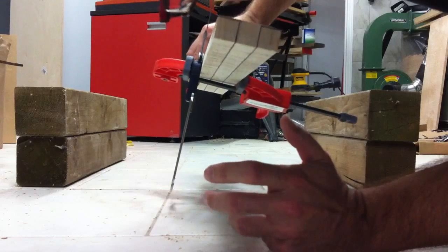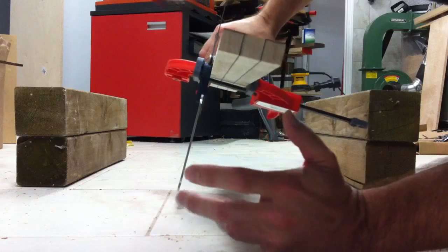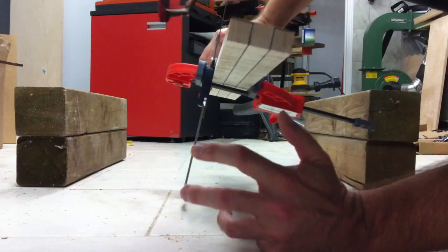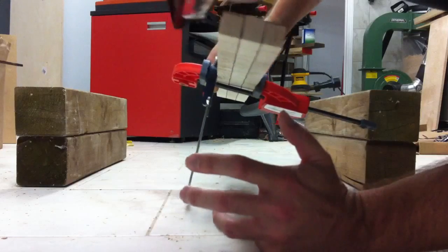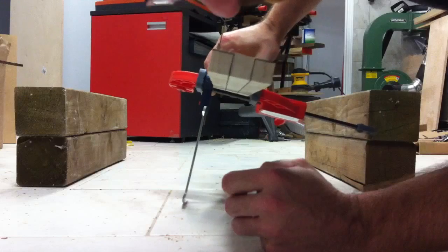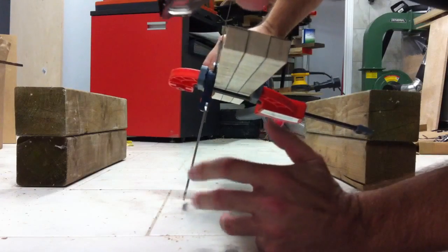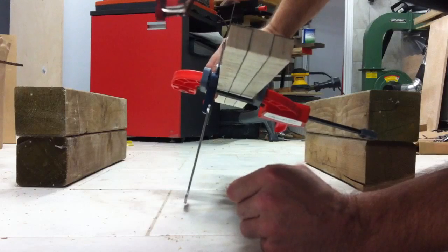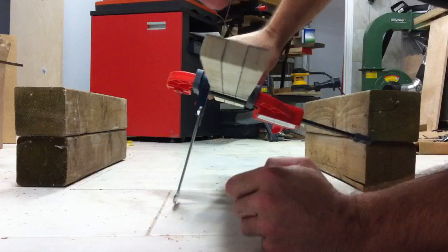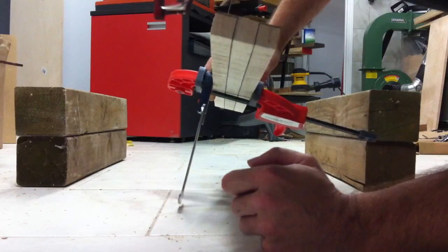With that in mind, I thought I've been thinking for years that I might want to try that with aluminum — with some aluminum L-sections. But combining aluminum with wood is sometimes troublesome because aluminum and wood expand and contract at very different rates, and that's been tried over the years with varying degrees of success. So I thought about carbon fiber. There are some pre-made carbon fiber angles out there, but I thought I would try it myself using wet layup techniques, and figured out how to do it consistently and repeatably.